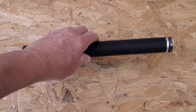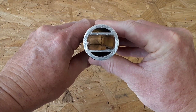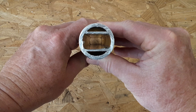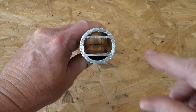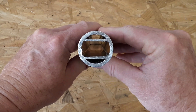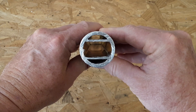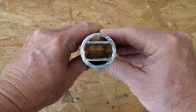The important thing when you're modifying the Cayman series is that this is the cross sectional area of the interior of the shaft. You see you have that rectangular section that runs throughout the length of the shaft, and that is where the wiring runs down — this center rectangular section here. So when you're cutting this shaft to modify it, you need to know what this cross section looks like because it won't cut like a typical trolling motor shaft.